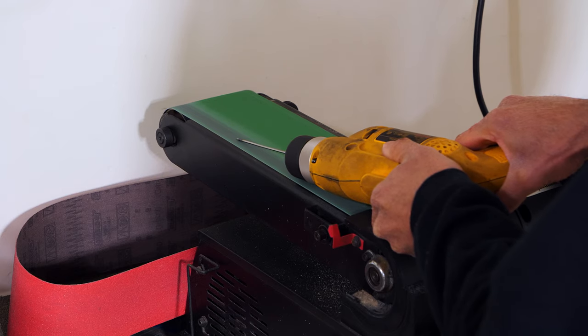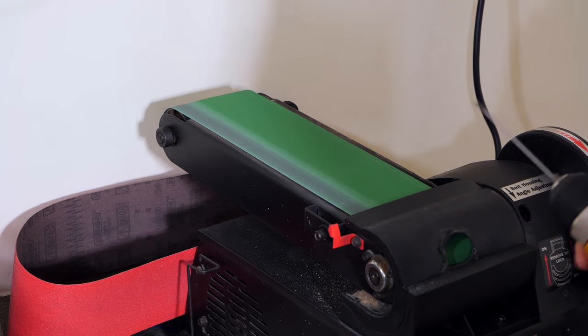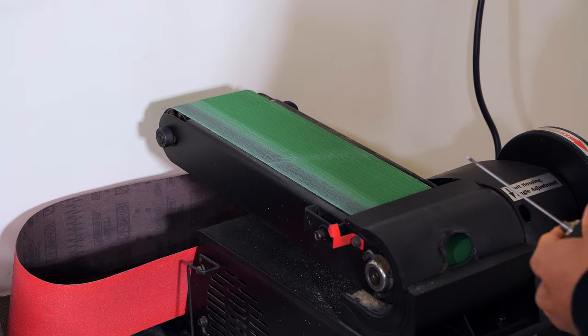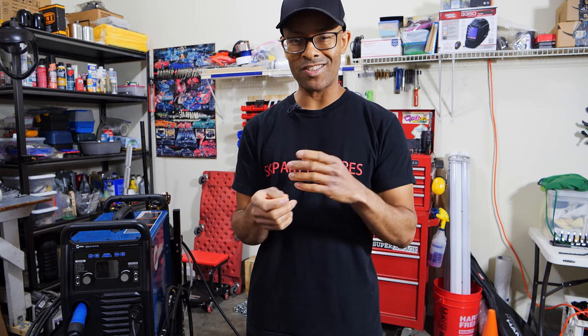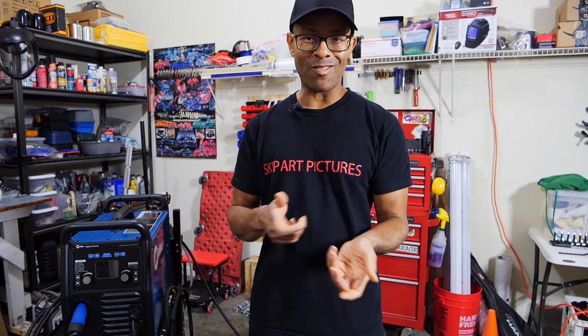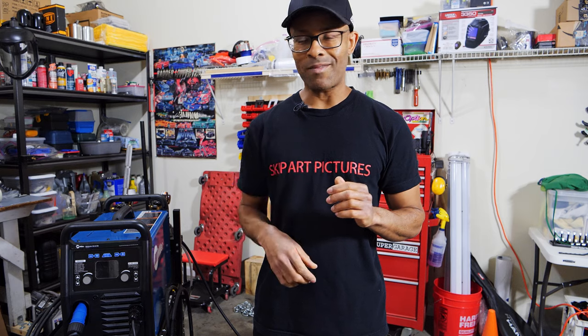And that's going to reinforce and really develop your skills so that you don't dip your tungsten. I feel like if you have a bunch of tungstens that are already pre-ground, then you'll just be like, dip, okay, just change, dip, okay, just change. But when you have to go to that grinder, stop what you're doing, set it up in the drill and grind away, you're just like, dang, I don't want to do this. And so it makes you really focus when you're TIG welding.